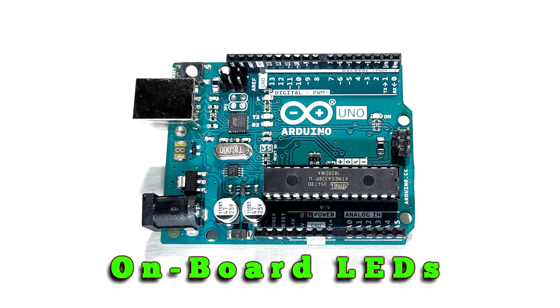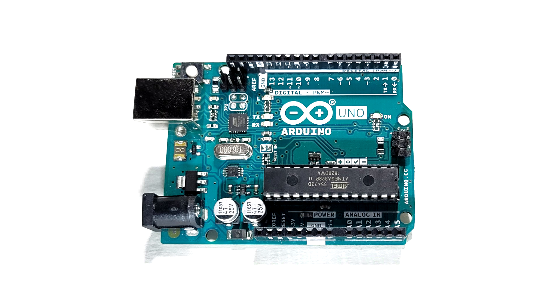There are four miniature LEDs on the board. Just next to the ground, next to pin 13, you can see an L — that is the pin connected to pin 13. Below that, you have the TX and RX, which will flicker whenever you have serial communication. Over to the right, you'll see an ON indicator that lights up when you have power on your Arduino. Right above the USB connector, there is a reset button — if you press this, it will restart your sketch. Now that we've identified the most important components, we'll save the rest of the discussion for another video.